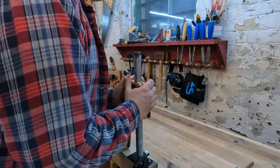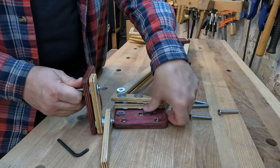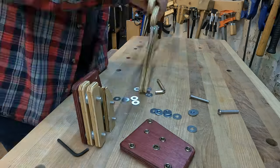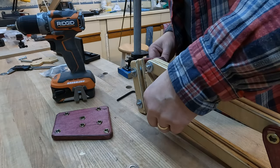Now for some reason my bracket was too tight — maybe the plywood was a little less than half an inch — so what I've done is added an extra washer to the middle of the parts that clamped the pipe. And to even up the spacing, I added an extra washer to the outside of the arm section before putting the plate back on.